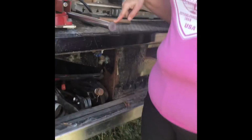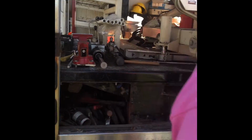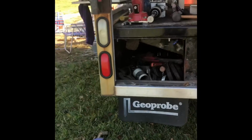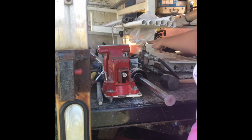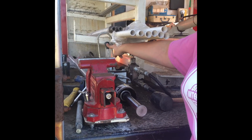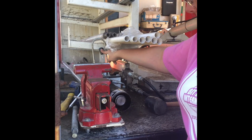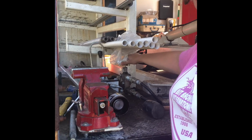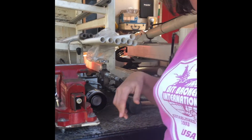the extruder comes out because there's a leak in the hydraulic line and stuff. You come over here and you turn on the secondary hydraulics, okay? Then you come over here, you turn it on so that there's some hydraulic fluid, and then you push this. This will have it go back in, or if you need to use it, you know how to use it, then you can tighten it up here. So the same thing happened again, and then that's it, and then you turn off the secondary.